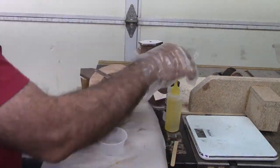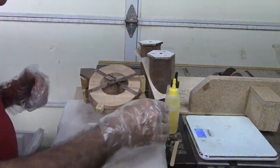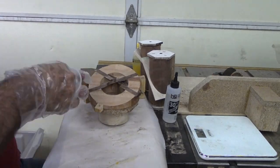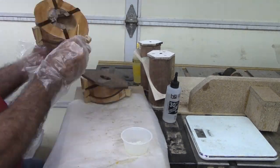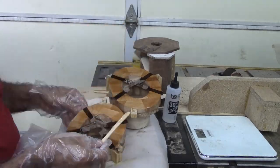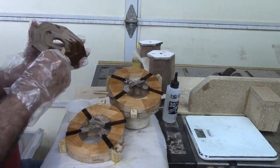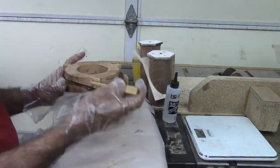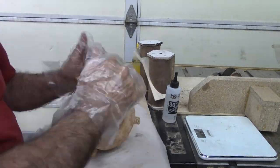Now to replace the wood I cut out with a segmented ring from walnut — this could be solid. The issue is that I must replace the same amount of wood that was cut out, including the kerfs — there are two of them. The thing to be careful of, if using segmented replacing wood, is that the ring is now oval with the length slightly but significantly longer than the stacked rings. I first check the assembly with the dowel assemblies in place, then mix up 30-minute epoxy, spread it over the four new surfaces, and assemble it all together again with the dowels. It is a messy business — gloves are essential. Then a chuck makes sufficient weight. With epoxy, I do not need a lot of pressure.